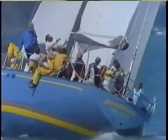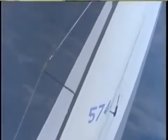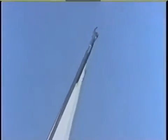In fresh conditions, too much power in the sail plan is every bit as inefficient as too little, since leeway and hull drag both increase rapidly at high angles of heel. On most boats, 26 to 28 degrees is the maximum heel for efficient beating. To control heel angle in heavy air and still have plenty of forward drive, you need good heavy air headsails properly trimmed.